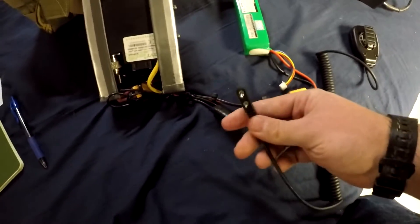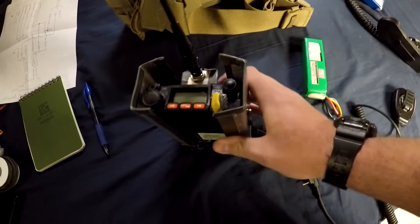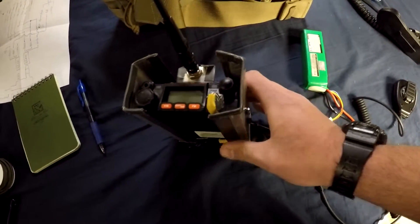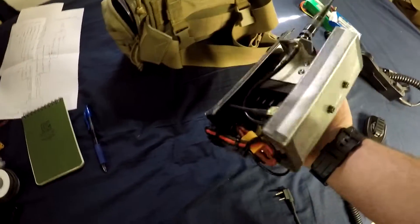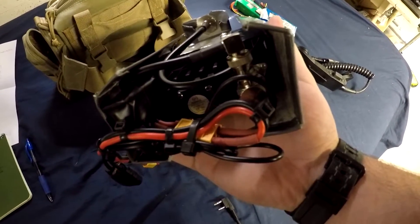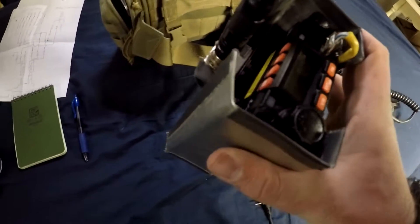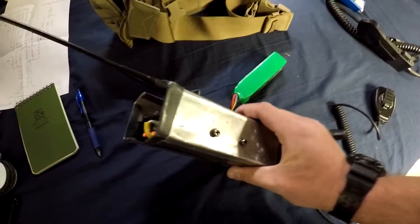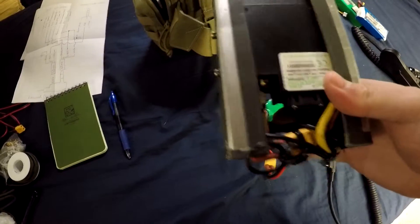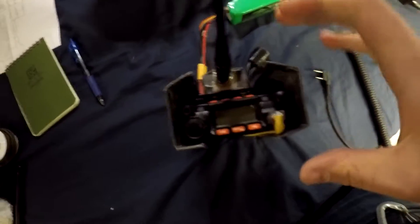Off this side it goes into a standard Kenwood plug. I've made this little pack frame — it's pretty light duty, just a little sheet aluminum that I had, which seems to be about perfect for this. It's still kind of flexible, not like a super durable roll-cage type of thing, but since it's in this bag it doesn't really seem necessary. The other main cable is a right-angle adapter going from PL-259 to BNC, and then a BNC bulkhead that runs to this little angle plate. I have the mobile mount attached to the radio and everything else attached to that. The radio is also able to tail-stand on a table, which is pretty useful — I can wrap the cables behind, set it there, and look down at it and access all the controls really easily.